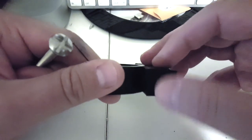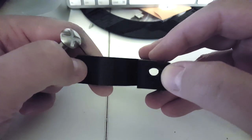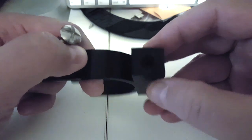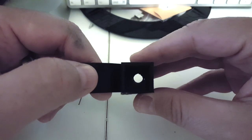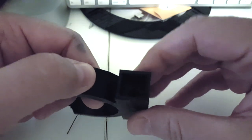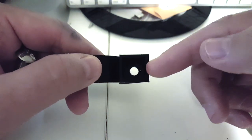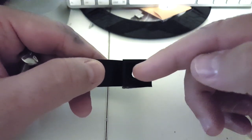You can see there is a hole for the tube, and this was also a little too tight, but I could drill it without shattering the plastic. I'll be able to drill this to 8.5 millimeters instead of having the printer make an 8 millimeter hole — there just weren't any tolerances, so that was bad. There is also a square hole here where I'm going to put a BNC connector through, and I hope it's going to be long enough to accommodate the length of the BNC — I'm having some doubts about that.